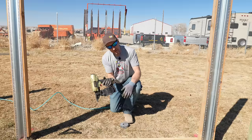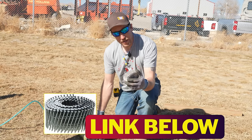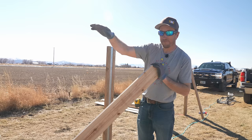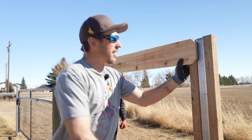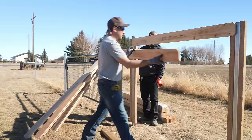To fasten the pickets, we're using the Magnum nail gun, and these are the nails we use: ring-shank stainless steel nails. Why ring shank? Because we don't use screws — screws take a lot of time and you can have just as much integrity with ring shank as with screws. The rings on the nail grab the wood so it doesn't work its way back out. I'm going to start from the top since I sided the posts in off across the top. I'll match the top of this board with the top of my 2x4 and match them up on their ends.